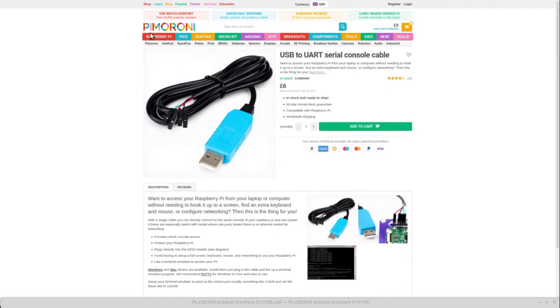This is another board I haven't bought — Pimoroni make great stuff. I'm in Australia and they ship here quickly at reasonable prices. The good thing about this is that it's a cable form, so if you don't know how to solder, you get something like this. USB to UART, USB TTL, or USB serial — that's what you're after. If you can't solder, just cut the wires on both the cable and the PlayStation link cable, twist the right wires together, tape them up, and you're done.